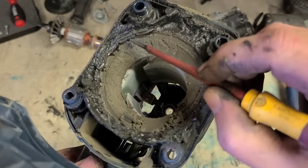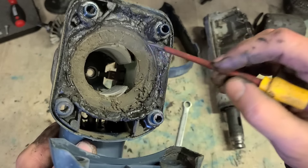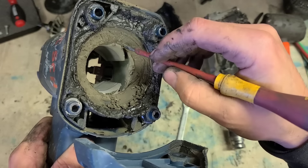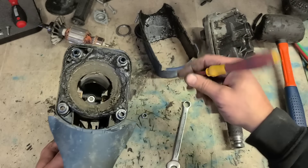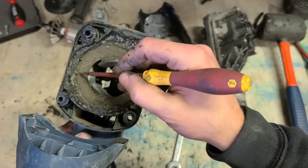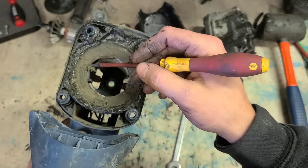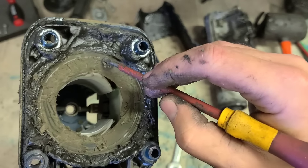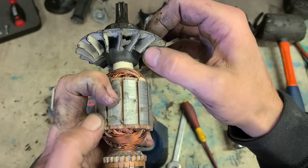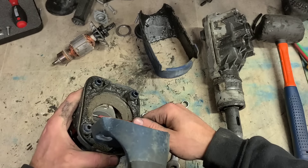You can see the way the fan was sitting on there — that might have been the reason why she was sparking. That fan is sitting up tight against that dirt, so it's all just oil and grease. But as the thing is being used, dirt, grit and dust starts sticking to the grease because the fan is actually sucking it up through here and blowing it out the front of the machine. So all the dust that gets in through here ends up on the fan area, which gets stuck to all the grease, so that keeps building up. As it heats up, it melts the grease which runs down and sticks more, so it starts to bind up. You can see the way it's smooth — that's because that fan has been actually rubbing against that, causing extra strain on the motor.